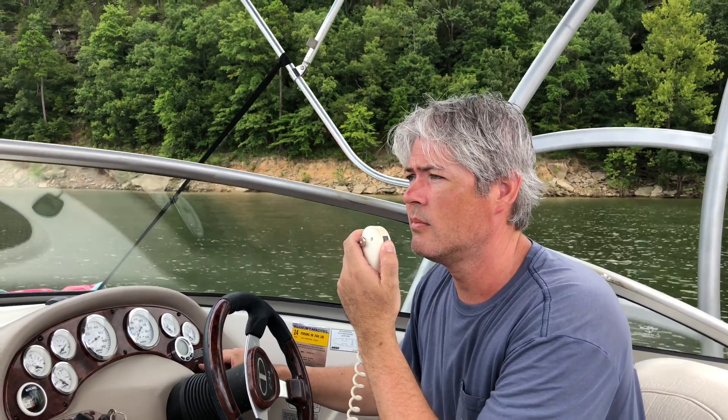Welcome back. Nothing can be as frustrating and potentially terrifying as a day on the water when your boat doesn't crank. I'd like to share a recent mishap we had with this boat — a Tahoe 234 — that involved the boat just not cranking, and when it did crank it would exhibit a beep every one minute or so. We tried some different things and finally settled on the solution, which was the idle air control valve. But to get there, we always want to try some other things first.